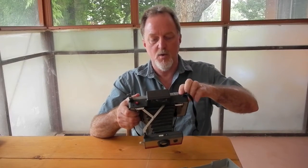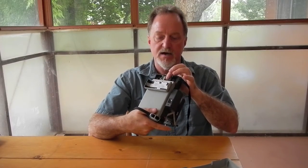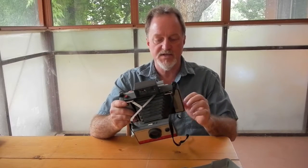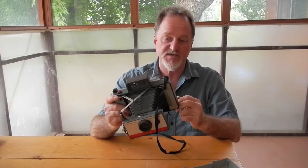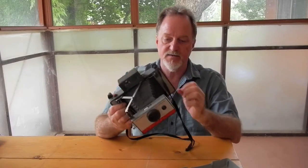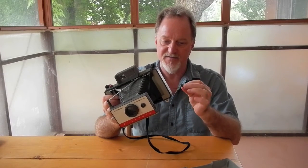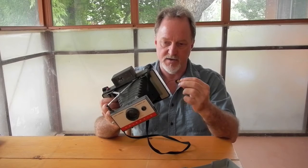This one needed quite a bit of work. The battery was really gunked up. I cleaned it off and I still wasn't getting continuity, so I ended up taking it apart and tracing the wire. Turned out that connection was okay — horses, not zebras — and I came back and this other connection was bad. Cleaned it up and soldered it back on there.